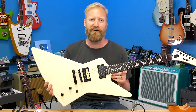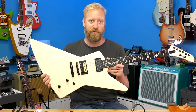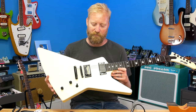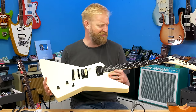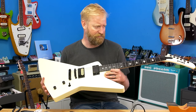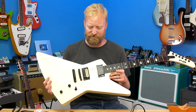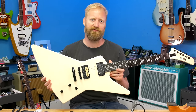This is starting to go in a more fun direction. A few people on the last video of this guitar said that they bought one, and I showed all the reasons why you're going to need to do work with this guitar when you get it. So I'm looking forward to people telling us what they got in the mail, what showed up, what work they had to do. Swapping the pickups I think is a must at this point. I'm apparently going to need to modify that tailpiece. I think it definitely needs heavier strings — the low E feels really floppy. This could take something quite a bit beefier. I'm probably going to try this with heavier strings before doing a full intonation and truss rod adjustment, to see where it lands. But I'd like to get it dialed in to play as nicely as it can, and then maybe I'll dream up some wild mods for it.